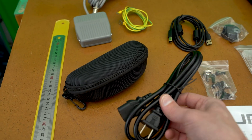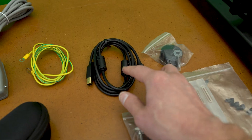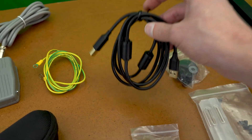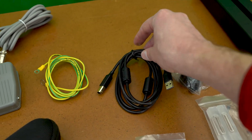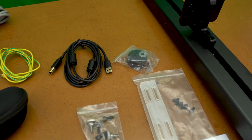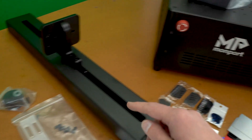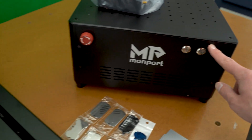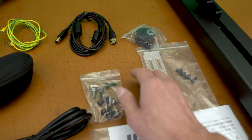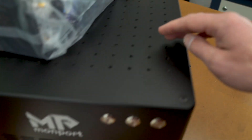There's some safety glasses, the main power cable, and a foot switch to activate the machine — perfect when doing large batches of items. Moving on is the USB cable, which uses a common printer-type connector, so if you ever lose or damage it, you can search for a USB printer cable to get a compatible replacement. There's also the assembly boom, which sets the focus of the laser. It is motorized, adjustable from the software and from the front of the machine, and there's also a hand dial at the very top for manual adjustment. There are a few screws and guide pieces for boxing in your work on the top surface.